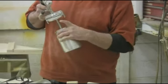All right, before I get going too far, Ace and Big Bob and some of the guys out on the forum have been asking about the pegs. Yeah, I went back and pegged mine. Do you have to? No. They're pretty much just for looks, particularly on this door where we've got the coping stick. It's just not doing a lot. So they're not in real deep, but it gives that old antique look of a square peg in a round hole.